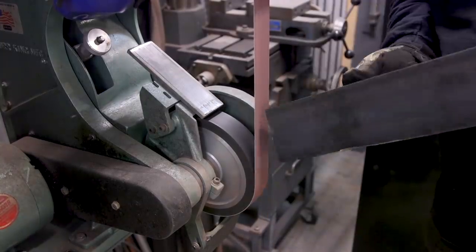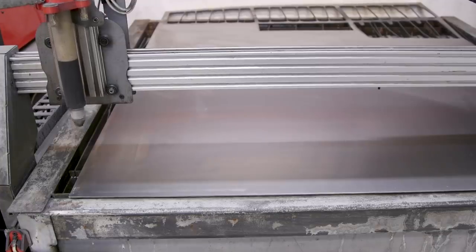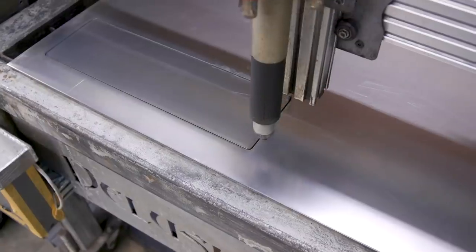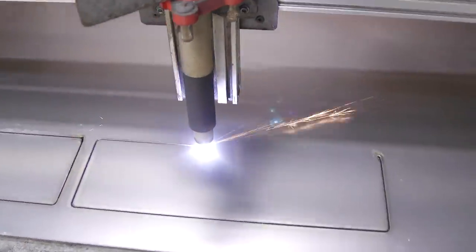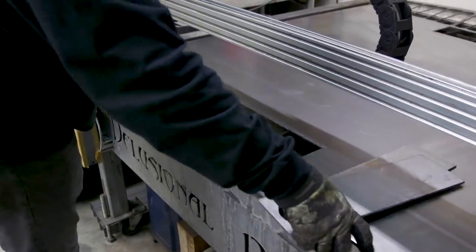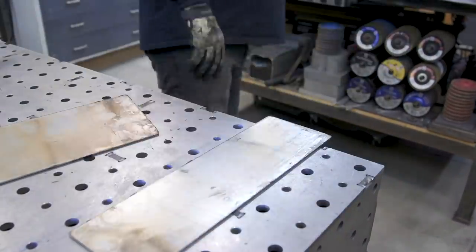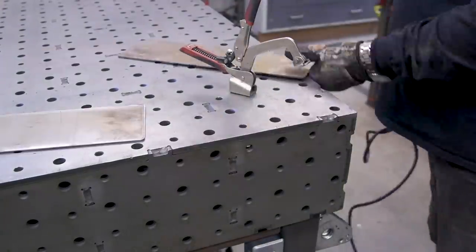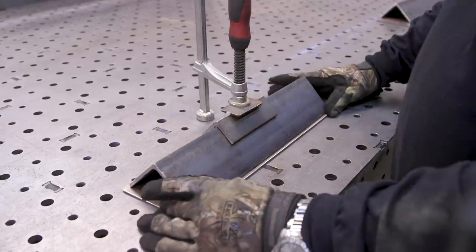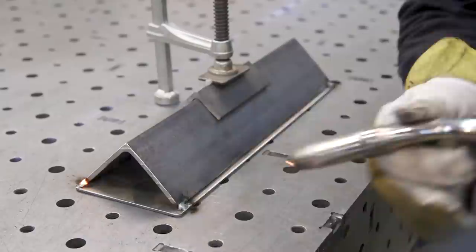I was able to find a piece of three-inch by 3/16 angle iron, and laying it flat I was about an eighth of an inch short. So I went over to the plasma cutter — I happened to have some eighth-of-an-inch thick cold-rolled sheet metal — and I thought it'd be a great solution to just cut a couple pieces out of that. You could probably do it a number of different ways, but this is just what I had on hand. Once I got them out of the plasma cutter, I knocked off a little bit of dross, then took the angle grinder and ground everything nice and smooth, rounding the edges up a little bit. Then I got it over to the welding table — I've got this jig I made for a project a long time ago, and it worked out really well for clamping and holding the angle iron down to the flat sheet metal.